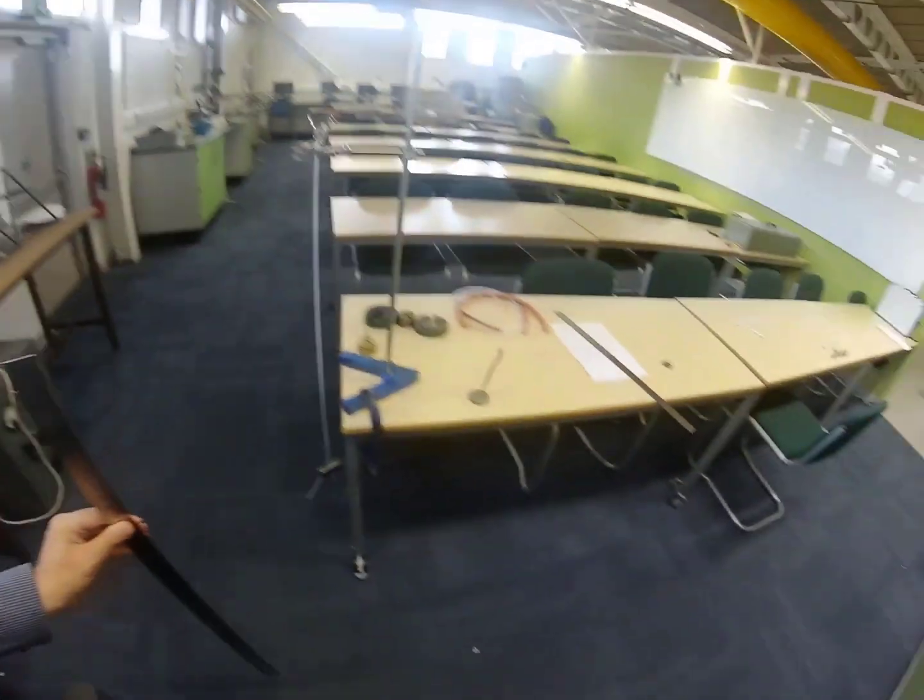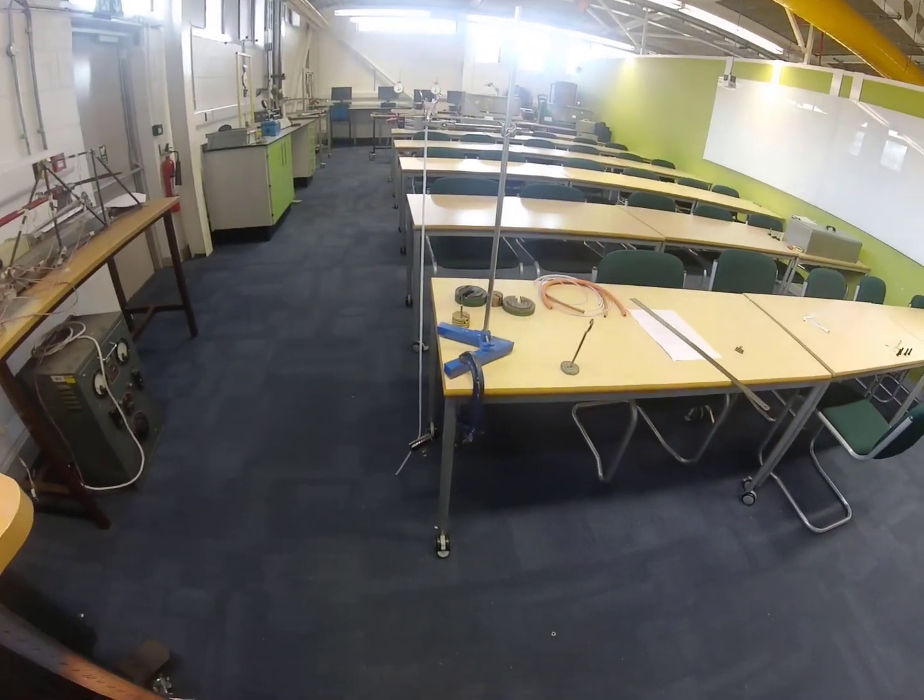Oh, there's something else I wanted to mention. But before I do the last one, what I'm going to do is measure this unloaded, loaded, and then measure unloaded again, doing that same check that we did before. Could there be some plastic deformation going on, or is it still staying elastic?